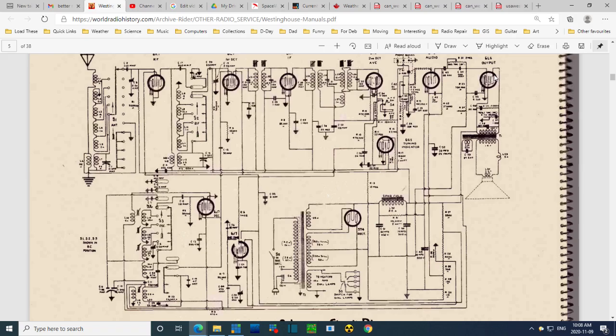What we really want to do is take the output of the 6L6 plate circuit. Actually, what might be better is to sneak a signal off the grid and feed it to a separate amplifier and speaker — completely separate — and just listen to what's there. That should be good enough. I'll pull this tube out.